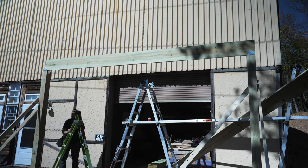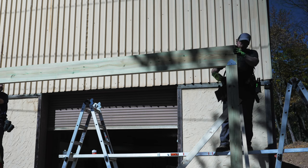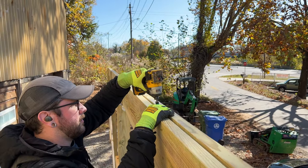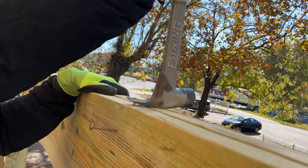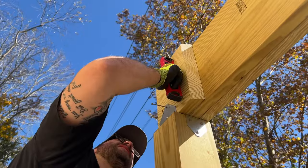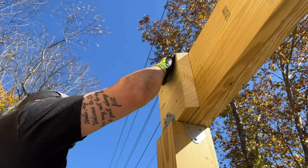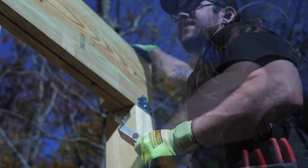Once the board was in place I got a few screws added to the bracket just to hold it, and Nate repeated on his side. We got the second board cut to length, lifted it into place, and then we could attach the two boards to each other. There are a few things to keep in mind when assembling girders: first, make sure the two boards are plumb before screwing them together; second, straighten the boards as much as possible while assembling them, and make sure they're flush on the top edge. I used a trick from my buddy Eric Perkins — adding a screw to the top edge of the lower board and using it to pry the board up even with the other board. Once flush on top and plumbed, I came back and added a row of three screws every foot or so to lock the two boards together into one beam. Finally we attached the beam to the bracket — since the post cap brackets are designed for a triple-ply beam I needed to add a filler piece, a scrap piece of 2x12. Each of these brackets uses 18 two-and-a-half inch screws in total, so these beams definitely aren't going anywhere.